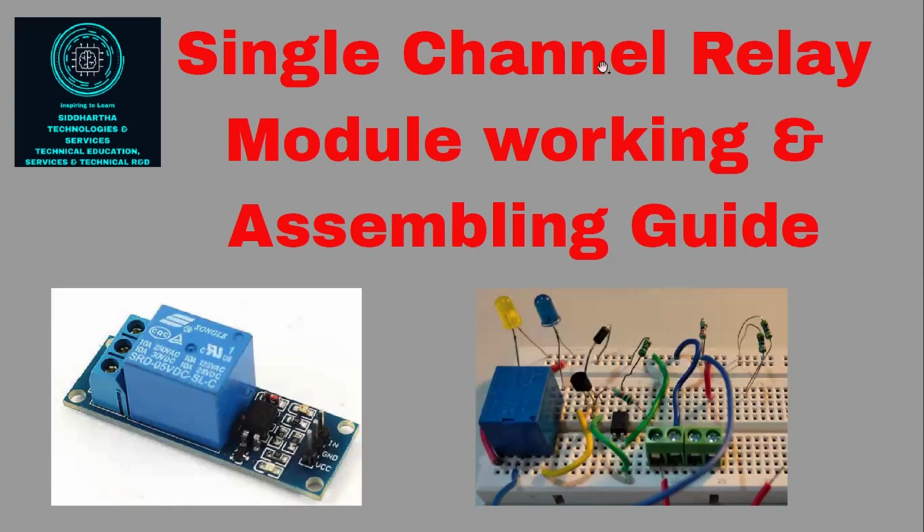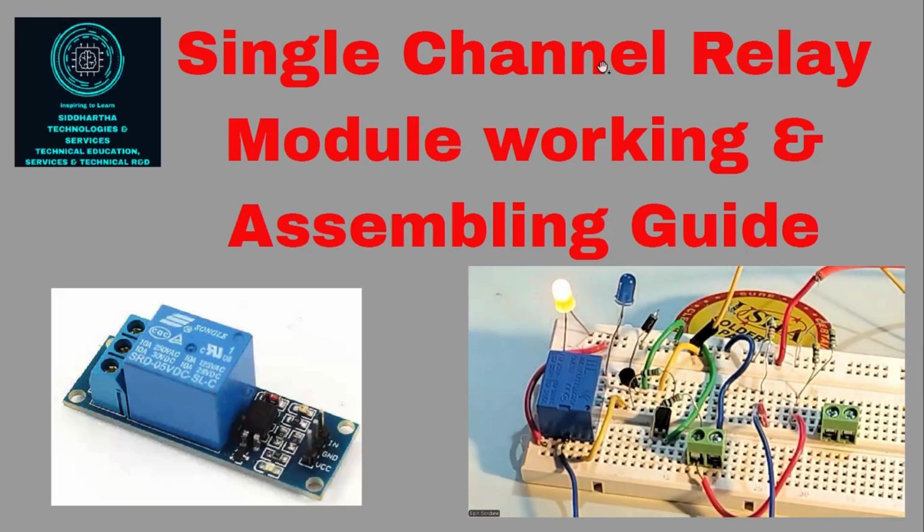One is a relay module circuit, that is a 5-volt relay with optocoupler. I will tell you what an optocoupler is. In the second circuit, we will discuss a relay module without optocoupler, using only an NPN transistor. And in the third circuit, instead of NPN, we will use a PNP transistor, also without optocoupler. So we will make these three circuits, and I will show you how it triggers, that means how we can operate it.